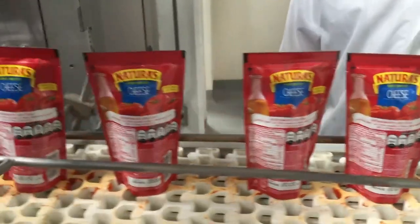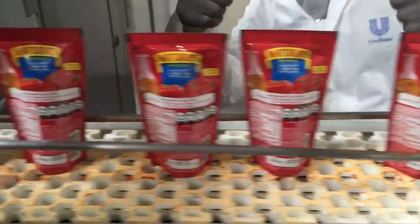As you can see from the conveyor and from some of the guarding, cheese spread seems to be everywhere. So it's highly likely that the seal surface is contaminated with this cheese spread. Due to the uniqueness of ultrasonic energy, it displaces it before the seal occurs, assuring a high-quality seal. Ultrasonic sealing is a very refined process, perfect for today's bio-based materials and the challenges they present, and for customers whose goals include reduced material usage and cut energy costs.